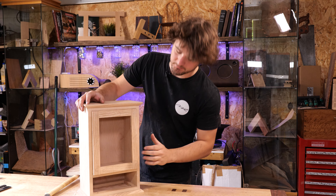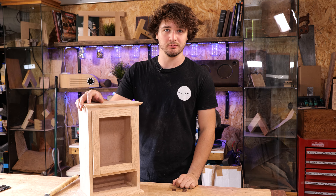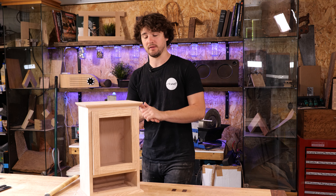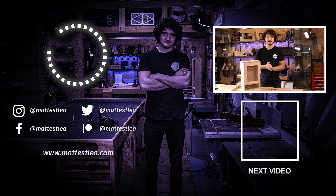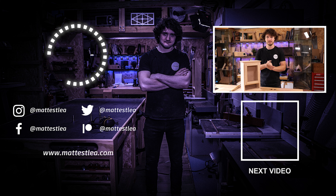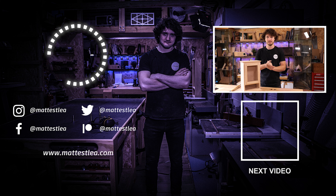The frame now fits within the cavity — it's a very snug fit, but we're going to be planing that down to achieve an even shadow gap around the outside afterwards. That's pretty much what you're going for at this point; if you can get it just to sit in there, happy days — we'll sort it all out later. In the next episode we'll be sorting out the panel for that door. Thank you very much for watching; if you enjoyed the video please press the like button, subscribe if you haven't already, and move on to the next lesson by clicking the link below.